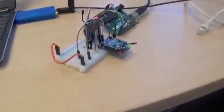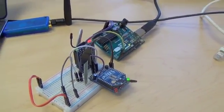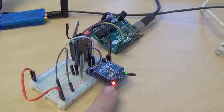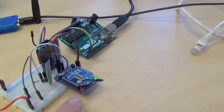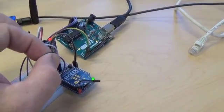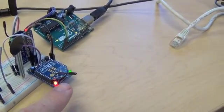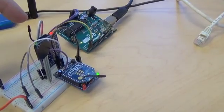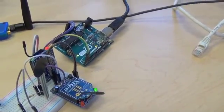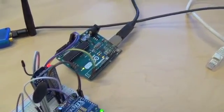This here is my little one node Zigbee network. This guy down here, this is the Zigbee router that is reading a digital input. It's on a little push button here. It's a digital input to that device. It is reporting data over the air from this little antenna up to this little antenna on the pan coordinator just a couple inches away, and it reports that data once a second.